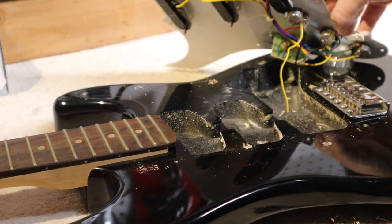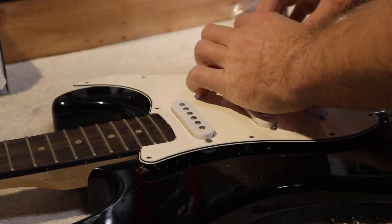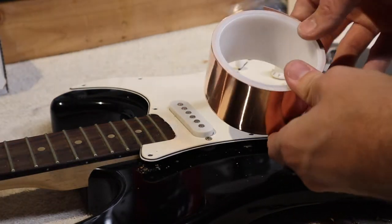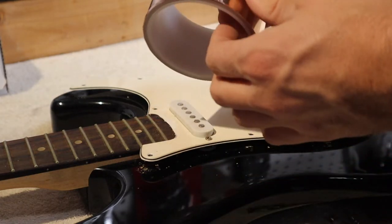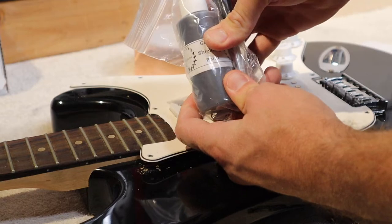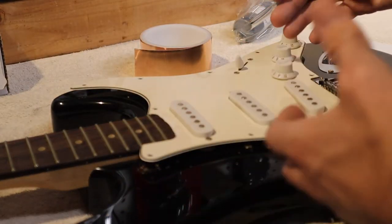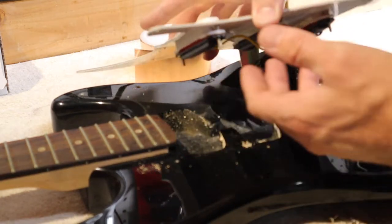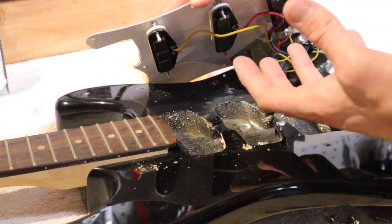There is zero shielding in this cavity — let's talk about that. When you're playing a guitar, you sometimes hear a humming sound, and that comes from radio interference getting into the control pocket. On my other guitar I took the time to shield it. One product you can use is foil tape — this works really well and you can pick it up on Amazon for a couple bucks; one roll would probably do 10 guitars. You can also use guitar shielding paint with graphite in it, or the easiest option: good old tinfoil. We're basically going to shield the entire pocket to prevent that 60-cycle hum from interfering with our electronics.